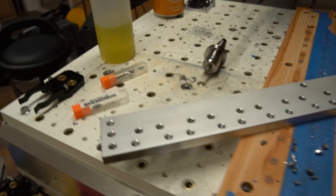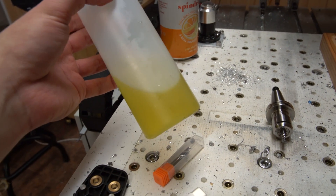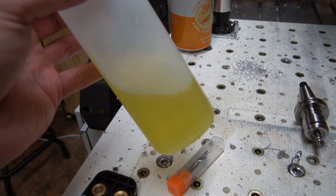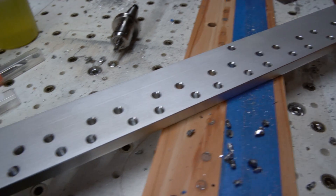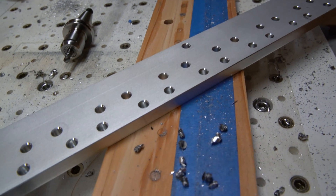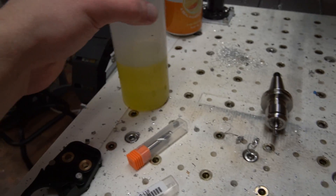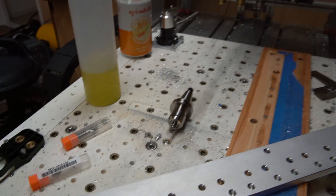Next is lubrication. If you love huffing WD-40 while machining, you're going to love this: a 3-to-1 ratio of kerosene to olive oil. I'm just a hobbyist, so take my advice with a grain of salt, but this is some of the best cutting fluid I've used. It reeks and is impossible to clean off your machine, but when it comes to lubricity it's absolutely phenomenal — it's near impossible to weld chips when using this fluid, assuming your speeds and feeds are within range.